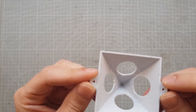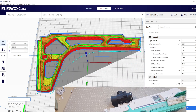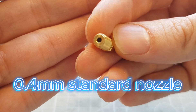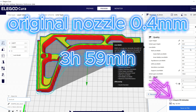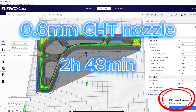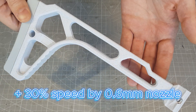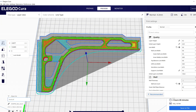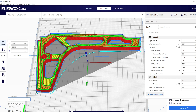Now let's see how it goes with the larger part at 250 millimeters per second. It's a shoulder rest I'm making for this pistol crossbow. At this speed, I had the first few signs of under extrusion when using the standard nozzle, even when using a completely new one. Just the fact that I now have more material flow because I'm printing with the 0.6 nozzle reduces the printing time from just under 4 hours to a more pleasant 2 hours 45 minutes. The print results with the new nozzle look like they did on the first day of the printer, but now it also prints a lot faster. The melting rate — how fast the material can be melted — is about 30% higher, and I could further increase the printing speed by about a third without having problems with too little material flow.